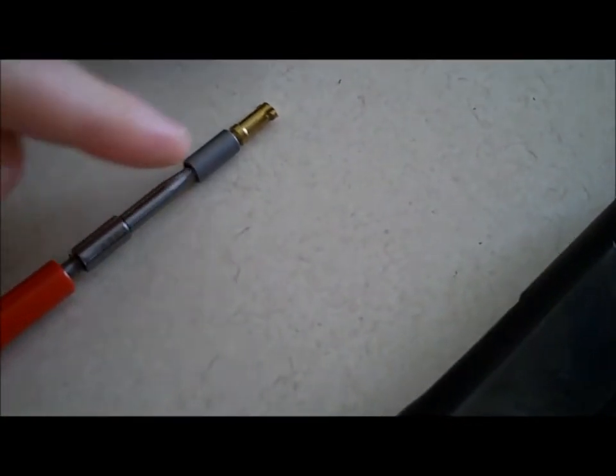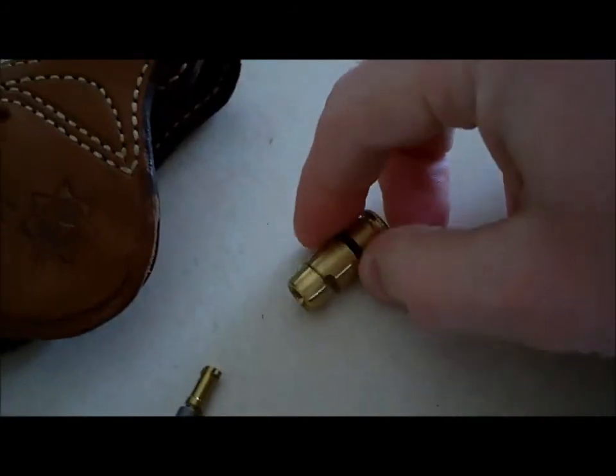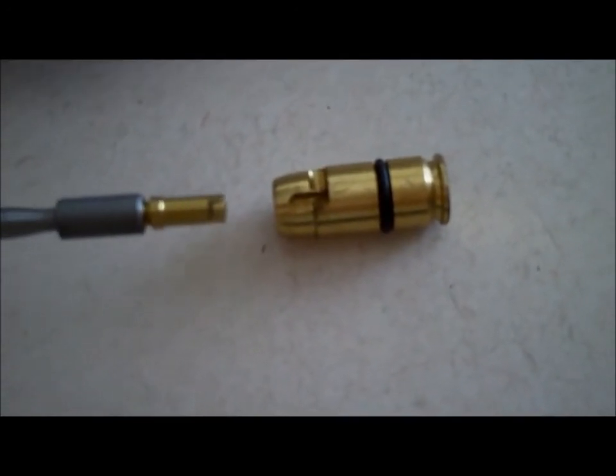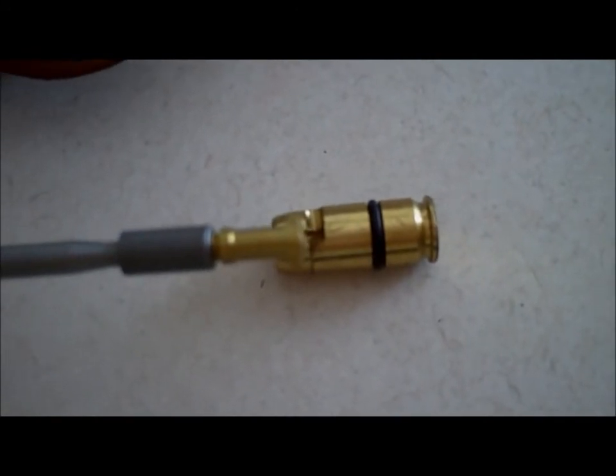Out this rod comes. You can see it's not very big, but it's adjustable — these links are adjustable. If you cycle the action on the weapon, which you're not going to be able to see but you heard — inside the weapon goes this little guy. It goes down the barrel, slides into the lock, and then turns. It's keyed, so it slides in and turns, and it will not come out. You can't fire the weapon.